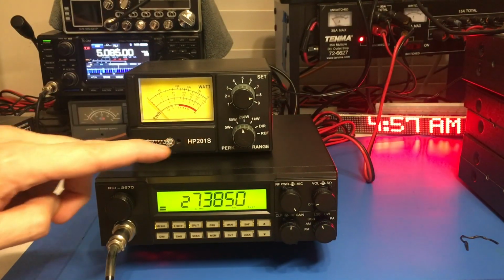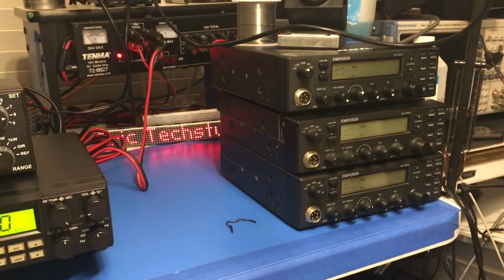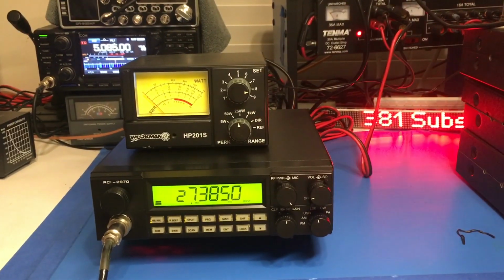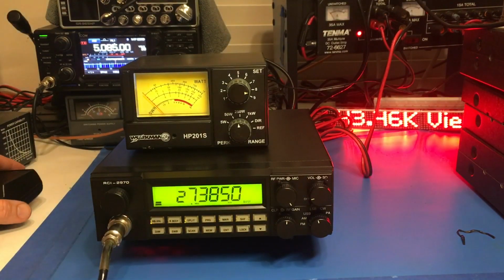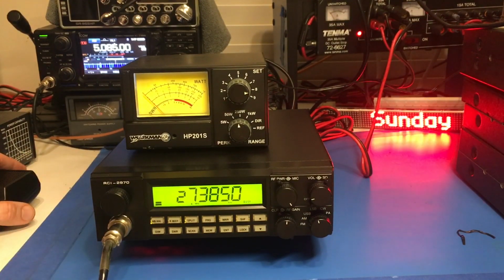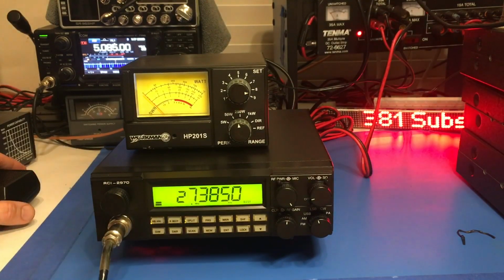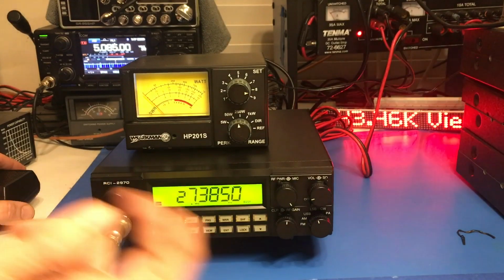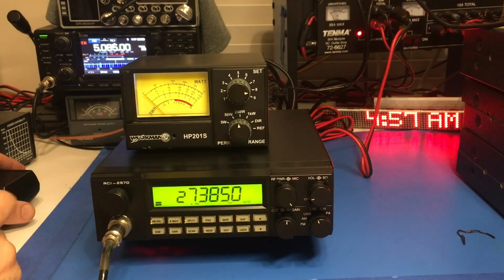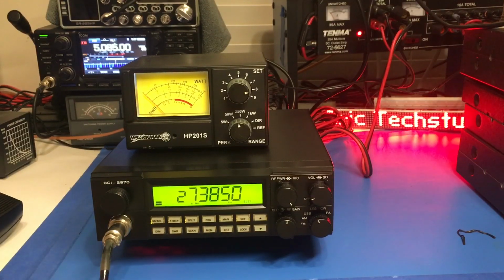And I'll just bring up one other radio, and then I got all these other ones to go through next, which are Emperors in another video. But I just wanted to give an update on another radio, very special to me now. But yeah, this one is pretty much done, but I think I'm going to go ahead and put the switches in. I hate to drill holes in cabinets of these, especially on the bottom side here. But then again, if I even replace the amp with the Connex, yeah, you want to be able to turn that off too sometimes. You don't need full power all the time. And it's nice to be able to just drop it out, hit that switch, and know you're not going to overdrive the radio. Nice indicator on that.